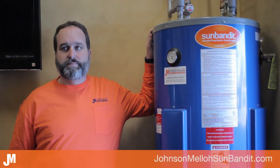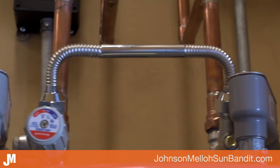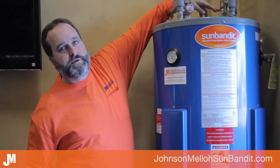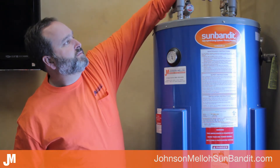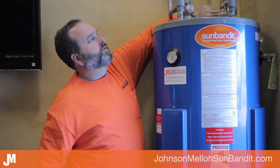The installation is just as standard as a residential water heater you would get from your big box store. There's not a whole lot of difference. The only thing that is different is that you do have a secondary valve here, which is your pass-over for your cold water to temper into your hot water side. You also have the feature of installing a hot water return pump in the system, with the built-in tap already in it in the front.